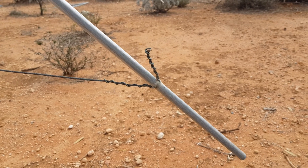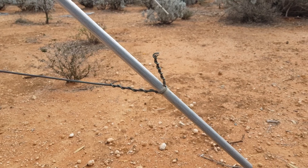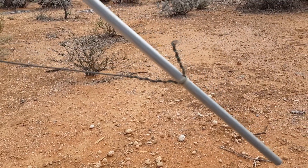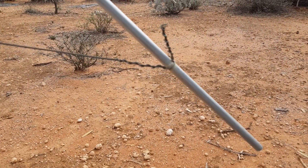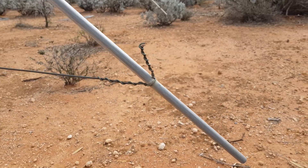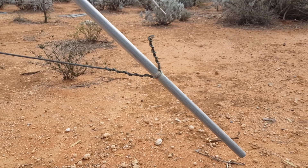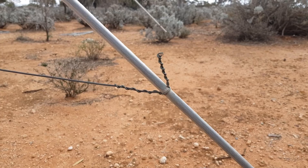I'm going to use galvanized fencing wire, which I've used on the 600-foot V-beam — that's a lot stronger. I think the reason they broke was because they didn't have any slack and were rigidly attached to the fiberglass spreader. The literature said the wire should have the ability to move through the hole, but I didn't do that.